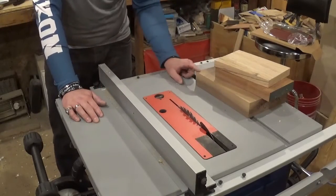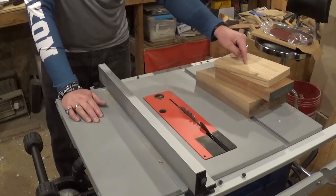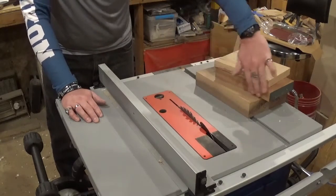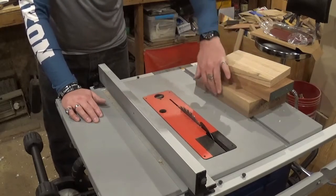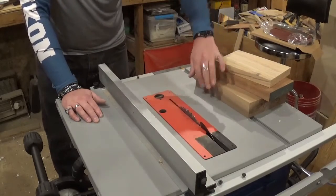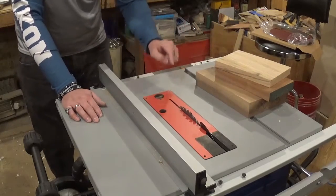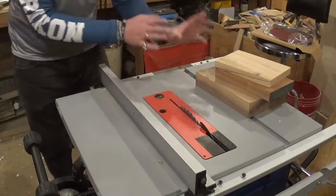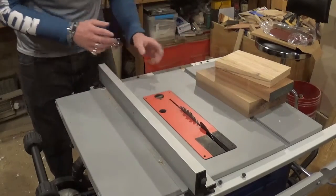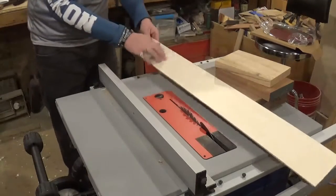And we cut through 2 inch walnut, 1 inch thick mahogany, and 3/4 inch oak, and you can see it is nice and buttery smooth. I would hardly even have to touch that with sandpaper if this was the final flush cut for something. And it's nice and smooth with minimal chip out and no burn marks. So the blade seemingly adjusts its speed depending on what and how thick of material you are cutting. And we even cut a piece of the 1/4 inch plywood here.